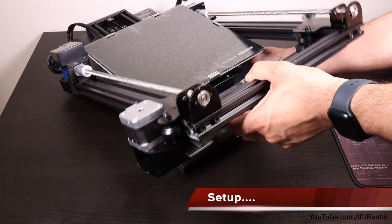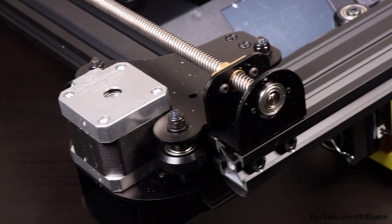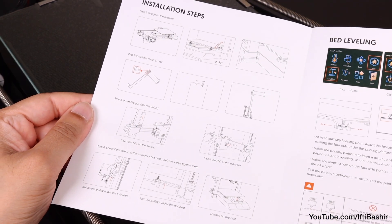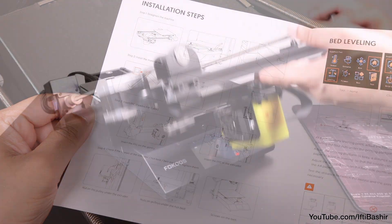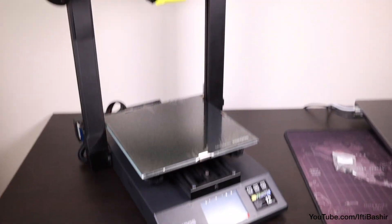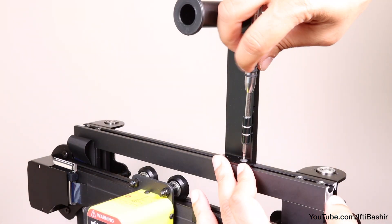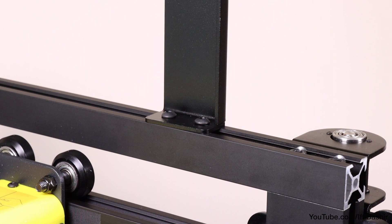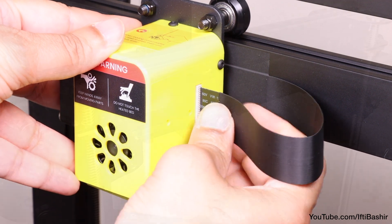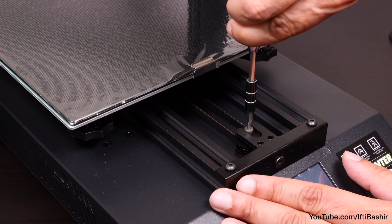Usually cheap bare-framed 3D printers come in various states of unassembled, but the Odin 5 takes less than 5 minutes to set up, considering it's 99% pre-assembled. The instructions only have 4 steps: first, unfold the unit and install and tighten the 4 Z-axis bolts, making the structure very firm. Second, install the filament spool holder into its bracket using the two screws provided. Third, insert the ribbon cables to the connectors on the Z-axis and extruder carriage, and finally check that the belts, pulley wheels and other screws are nice and tight.